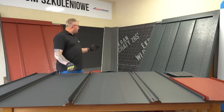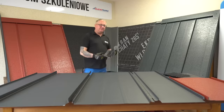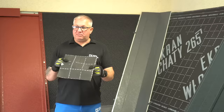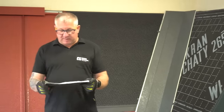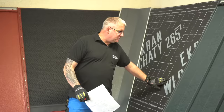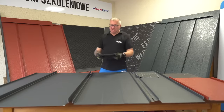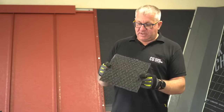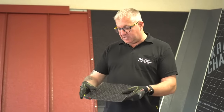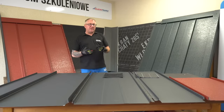In terms of roof build-up and membrane use, there are many different options and whatever is shown in the installation manual or in our videos might not suit your individual situation. Two possible options for the installation of standing seam panels: a high quality thick membrane installed on top of a boarded surface, whereby there still needs to be an air gap in the build-up underneath — possibly in between the rafters and the boards. A special metal roofing membrane, often called a metal carpet, can be used. This is a very advanced option and it is highly recommended for larger and more complicated projects. The membrane will take care of the condensation created on the back of the roof sheets and also allows movement due to heat expansion of the panels.